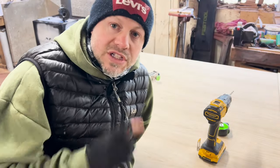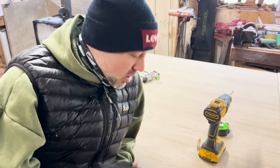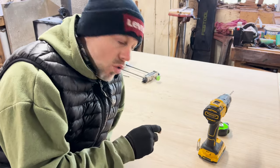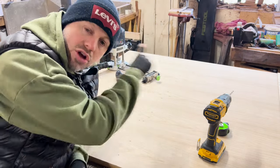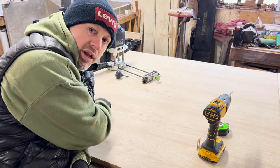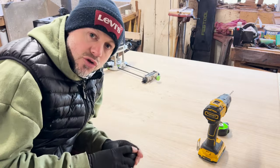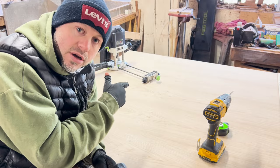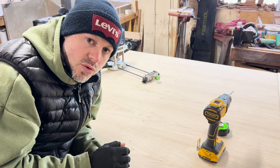So I've got the whiskey barrels ready. I'm now going to make tops and shelves for them. So I'm using this oak veneered MDF. I'll use the trammel on the router to cut a circle. To do this, I'll drill a hole in the centre here, and this knob will be screwed into the hole, and when I use the router, this gives me a centre point and I should get a perfect circle.